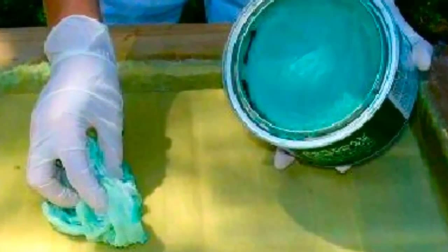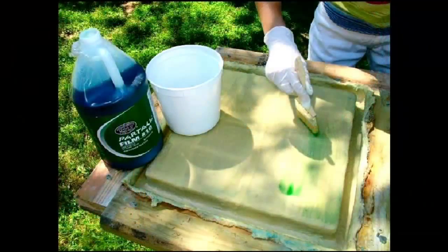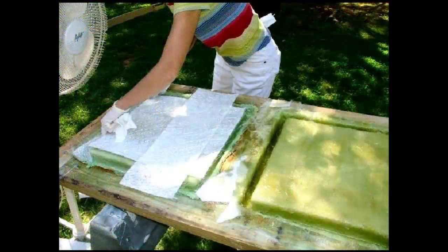And I begin covering the latex mold thoroughly with a mold release wax. When the wax is dry, I add a second type of mold release, which is a liquid. I paint in a coat of PVA release and allow it time to dry. Strips of fiberglass mat are cut to fit the latex mold and laid on top to wait for fiberglass resin.